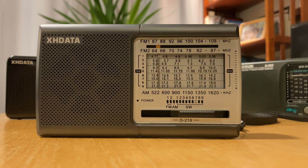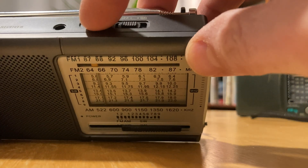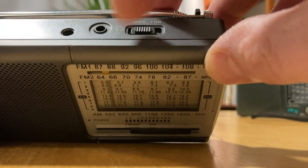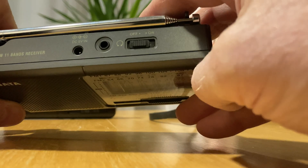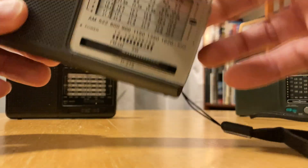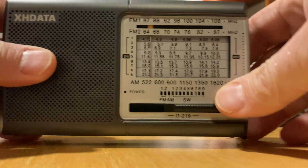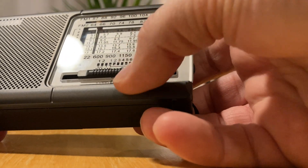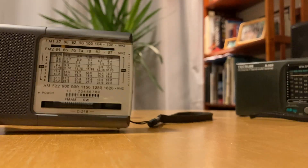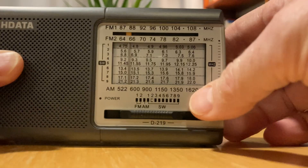So let me show you its behavior. The ergonomics on this are great. There's a power switch on top, headphone jack, DC in at five volts — which means you can drive it with a USB power supply. It's center negative, just so you know — you'll have to make up or get a cable for that purpose. On the side you've got volume and tuning, and in the back you've got a stand and two double-A batteries. There are little indicators on the front for the band, so you can see the band and your tuning without having to look at the top of the radio like you would with the 909. Much improved ergonomics, similar to what the D328 does.